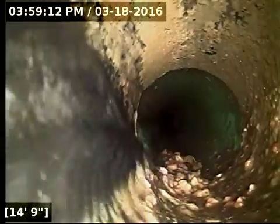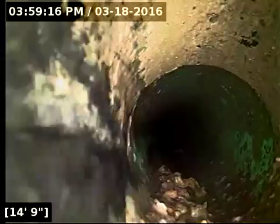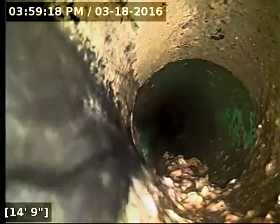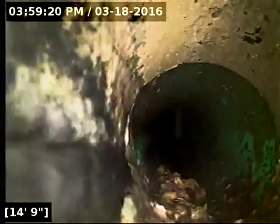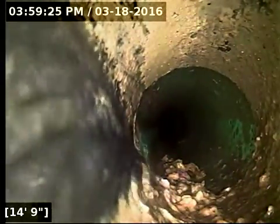It's strange that you get this kind of debris buildup right here isolated to just the joint. Nowhere else in the line do you have debris buildup. So that makes me concerned. There could be roots that have come through here, and the debris is just covering them up. Now, my reason for recommending the HydroJet, and again, I would do that with caution, is to try not to jet across too quickly so that you don't cut anything out of the way before our camera goes in. But apart from that, the line is functioning properly at this time.